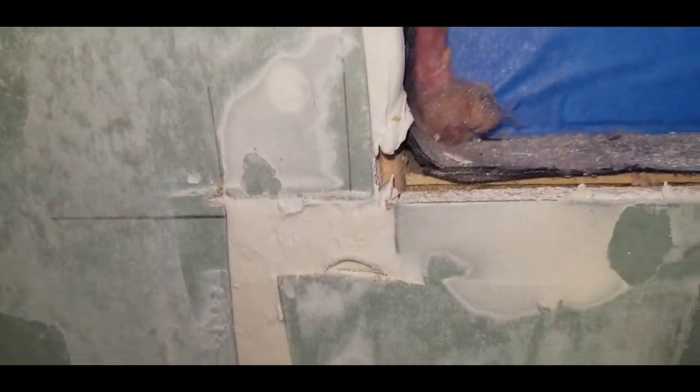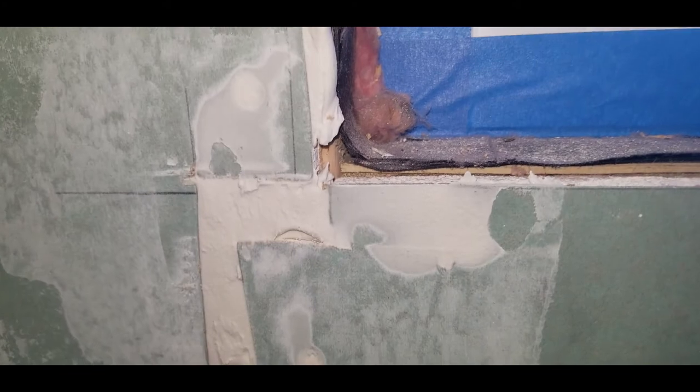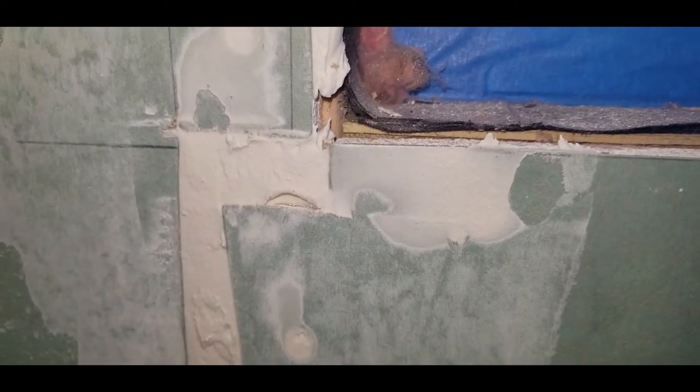This is going to crack, and that's fine, because if I try to put tape over it now, what's going to happen is gravity is going to make the wet spackle belly out. And then the tape's going to be sticking out. And you can't sand off the tape, or it defeats the purpose of putting the tape on there. So if this dries and bellies out, no big deal. I can sand it flat. And then I will put a thin coat of spackle on it and put the tape on it, and it'll be done properly. I guess next we will tackle a corner.